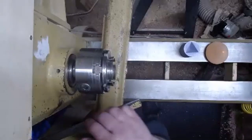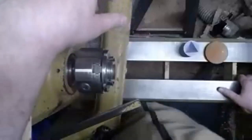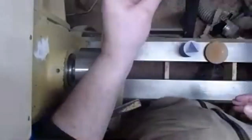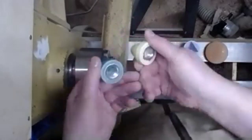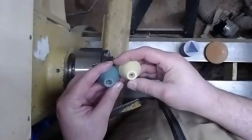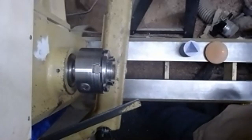I just have the rubber Chuckys that are for the finials, doing the really fine, long finials. Those are really nice. I keep those here. They've got little bearings inside of them. So you basically put the finial in there — this has the insert on the back — and the bearing just rolls with it. It's really cool. Takes the vibration out and holds it steady.